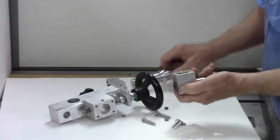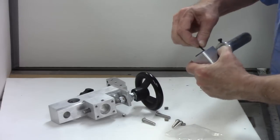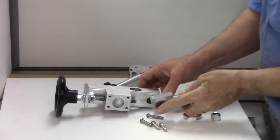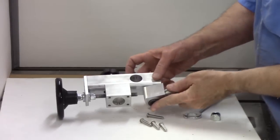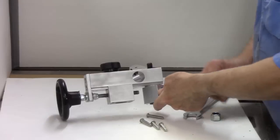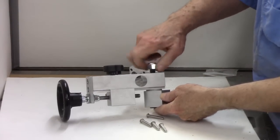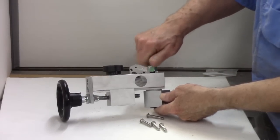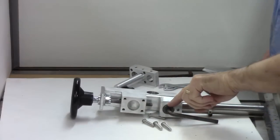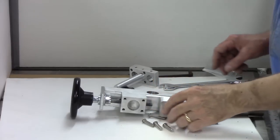It's actually going to mount on here. We take the tool post and the swivel assembly — it's got a large nylon washer in there to make it easy to turn. It's got a lock nut. We put that lock nut on there and then you get a three-quarter inch wrench and you tighten it down. There's some knurling on this swivel bolt so I could probably grasp that with a large set of pliers.